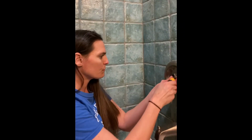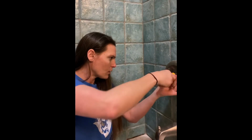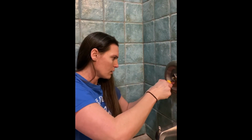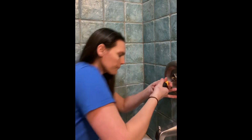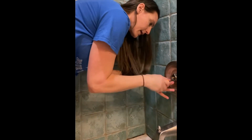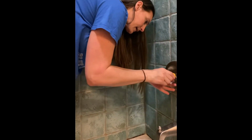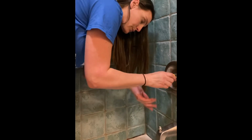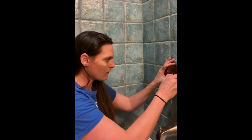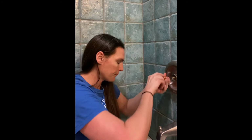I'm gonna do a little troubleshooting. I'm gonna back out. Yep. Okay, so if you over tighten these screws, I guess what happens is it pulls all the plumbing forward and shoots that away from the wall. Cool. That's good to know.